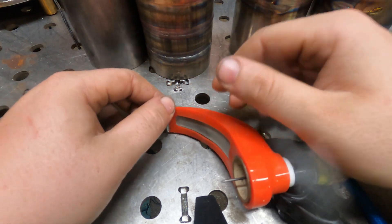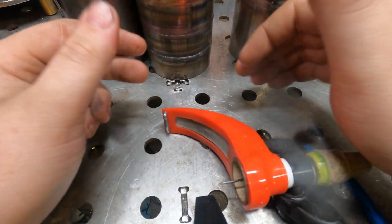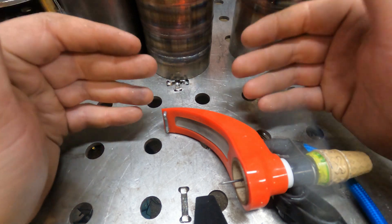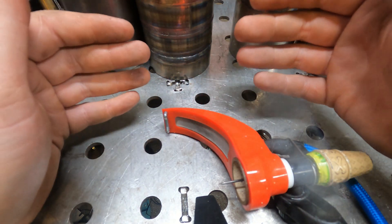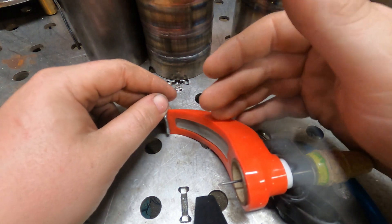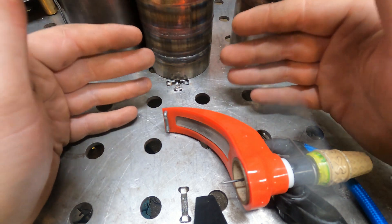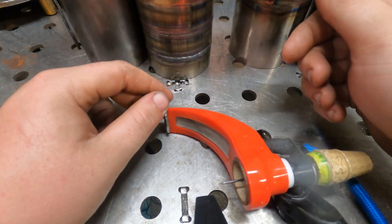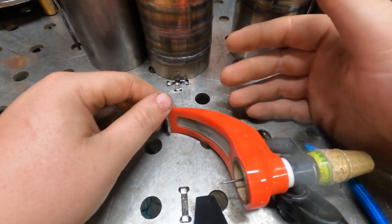That's another video I'll be releasing once everything gets here and I dial in settings. But if you already have a dual regulator, you can use this — it's not going to be an issue, it'll work perfectly. I want to make it so you don't have to shut your valve off every time you're done. If you run a dual regulator or something like a No Corners Cut Fab distribution block or panel, what's going to happen is every time you're done welding and not jumping into another weld immediately, you need to turn that gas off — otherwise it just keeps continuously flowing. To me, that's just another step I don't want to have to remember.